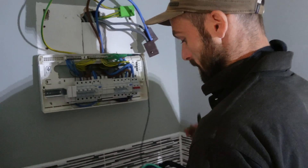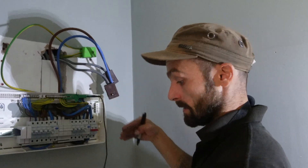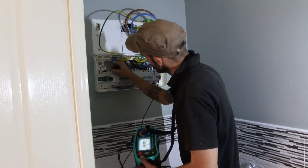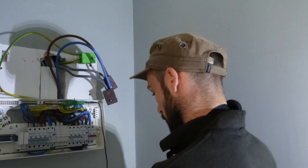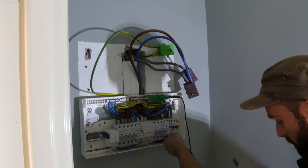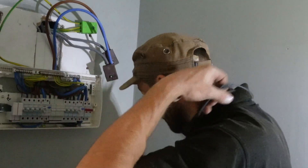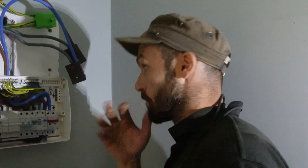What I've just done is an earth fault loop impedance test. Now that I've moved the mains, I should recheck to make sure I've done everything in the correct polarity and that the earth reading to the property is where we want it to be. I'll record that on the back of the fuse board — always a good idea for future electricians — and that reading is well within our permissible limits. While I'm here I'll also do an RCD trip time test to make sure the RCDs are still operating properly, then I'll re-energize the house. Some of the fastest readings I've seen in a long time — everything is operating fantastically, as good as the day it was installed. I'm happy to re-energize all circuits and re-label everything accordingly, as I've had a slight rearrangement of the circuitry.